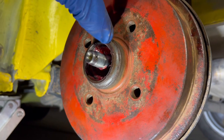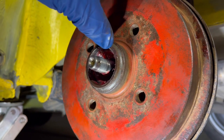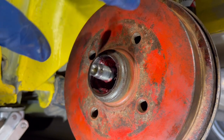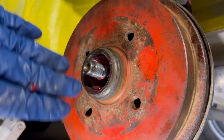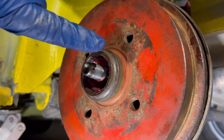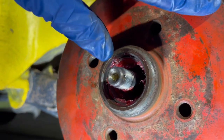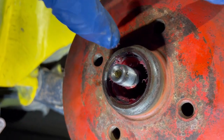I test fit the new bearing and it fit fine. Keep in mind the tolerances may be different, so you definitely need to polish the spindle to the new bearing, not the old one. I checked it, everything was fine — got it on and I'm about to put in the outer bearing and reassemble.